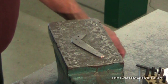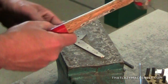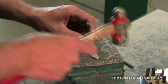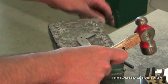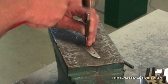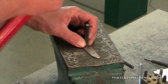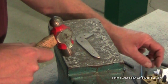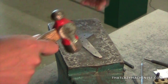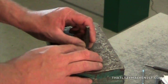Once hole A is complete, we can move on to hole B, which is a 6-32. So we can return to our medium-sized ball-peen hammer, find our number 6 number punch, and start the whole sequence over again. So I've lightly punched 6-32, so I'm going to readjust a little bit — I'm going to move my 3 slightly to the left.